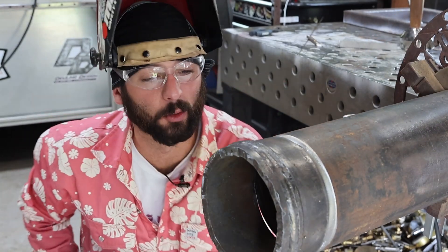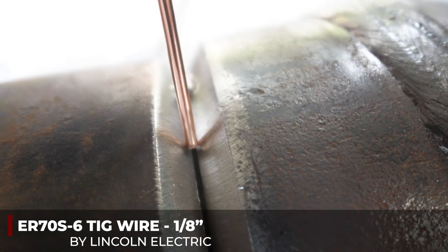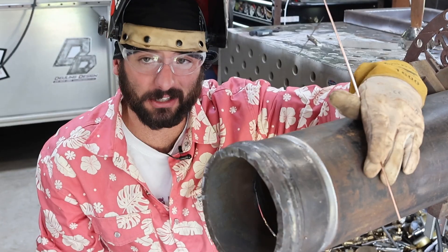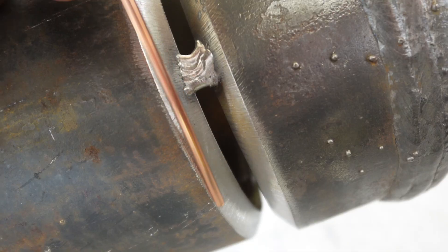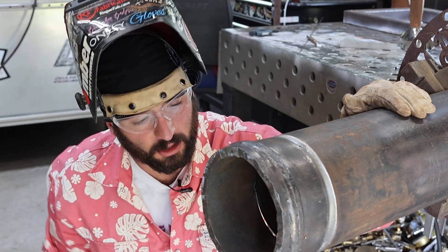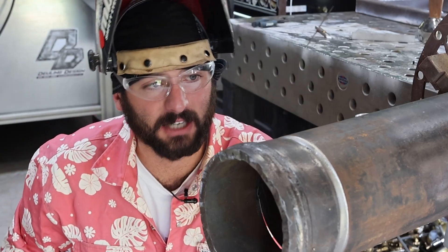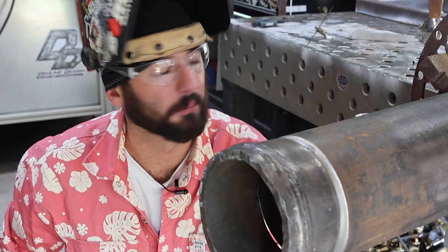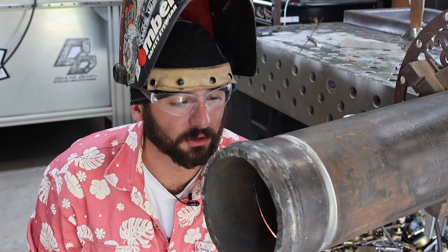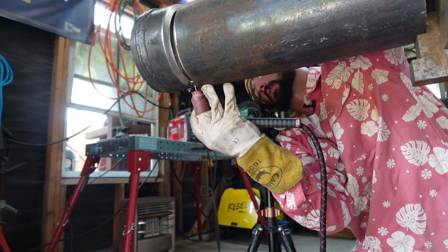One of the first things we've got to do is evaluate the weld we're walking up on. We've got it fixed in position. We've got a really tight gap on top — probably close to a sixteenth of an inch — and about a sixteenth of an inch of high-low on the top. But the tight top is actually quite okay. The bottom though — that's at least a quarter-inch gap. We've got a lot of wiggle room for our one-eighth wire. I'd like to say it's not the worst I've seen. We're going to start on the bottom tack and work our way up.